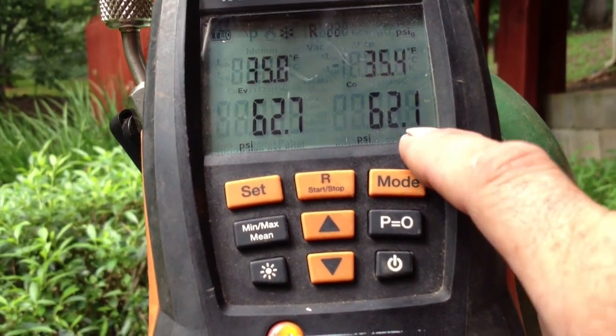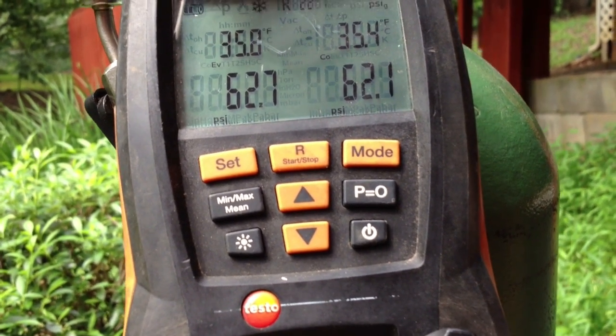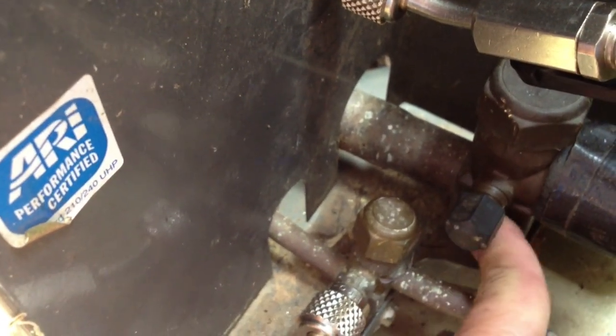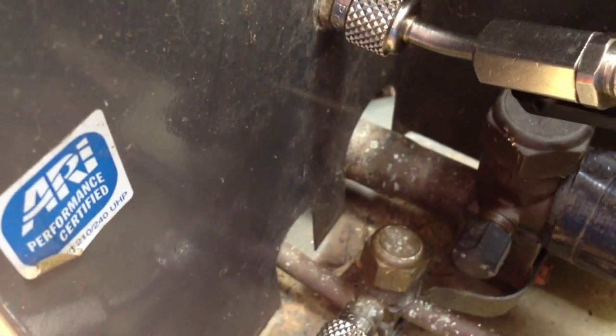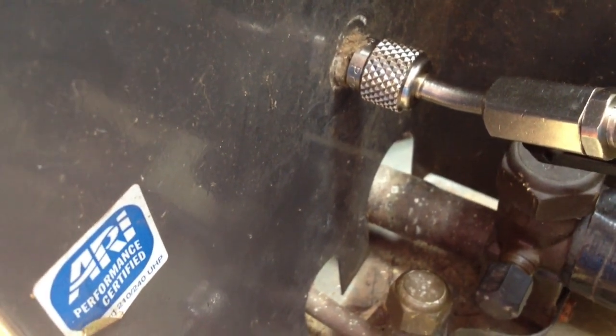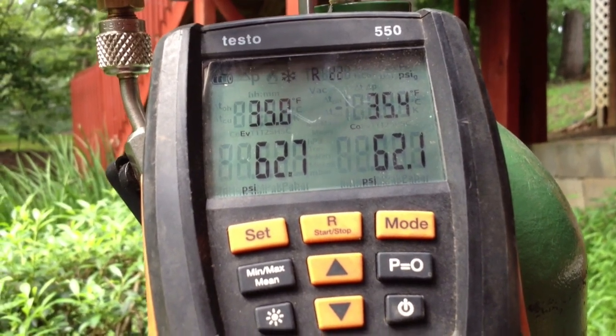About every 10 minutes this one will fall. I'm going to give it another 15 minutes and see where it goes, but I really truly believe that it's in the coil. It could be a chance that it's in the caps — the main valve caps or the Schrader caps — and I'll use some Nylog on those and see if it leaks by there. But I don't really see any oil, because this thing was completely out of Freon since November. So there's a pretty good-sized leak somewhere. I didn't see one in the outdoor coil, but of course the pressure on the gauges isn't showing me that the outdoor unit is leaking. Sometimes you do have to isolate them like this, but there's a much easier way than cutting it loose and brazing everything up — you just get a set of digital gauges and you can actually watch.